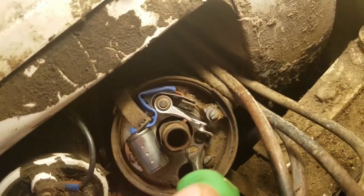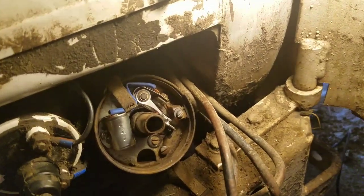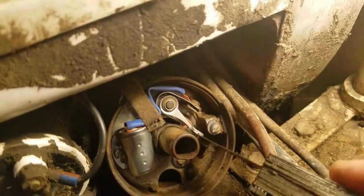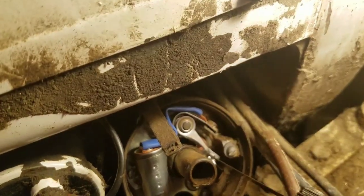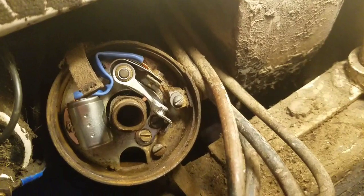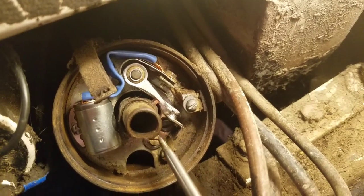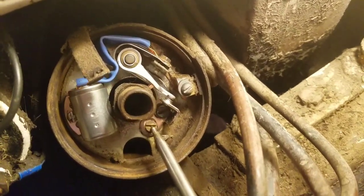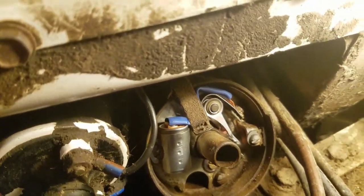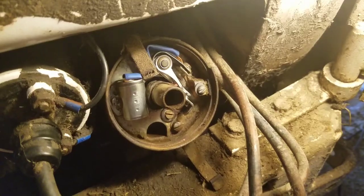I'm going to need two hands to stick the feeler gauge in there. Alright, so stuck the feeler gauge in here as I was turning that. Said sorry I needed two hands. We stick the feeler gauge in there, just a little bit of a drag, and then you'll tighten down that screw there, so I can actually point with. Tighten this down right here, and then it's now tight, but this is the one you make your adjustment with, and then tighten this down, recheck it again, and that's how you do that. And then we'll show you how to check it.